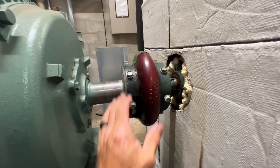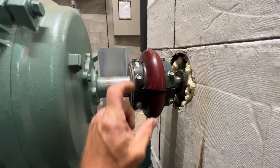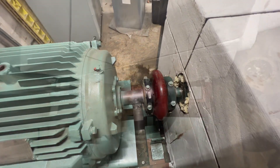They're lucky it didn't rip off completely. For this size, I think these couplings can tolerate maybe a quarter inch out of alignment. We'll check all that and pull this apart. I've got a new coupling to put on here, and this is how it's done.